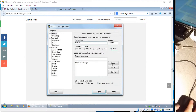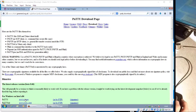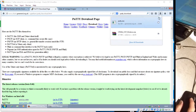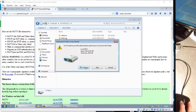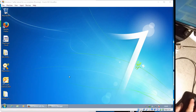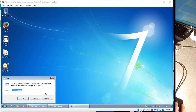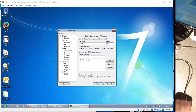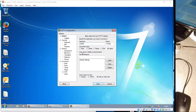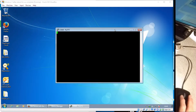The instructions say you need PuTTY, and I also prefer PuTTY. I'm going to put that in the root of my C drive because that's where I find it easiest to work with. So: run, cputty, serial, 115200, and it's COM 3. I'm going to save this so I don't have to type it if I have to reconnect. Supposedly I'm now connected to the Onion Omega.